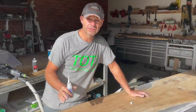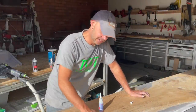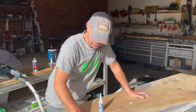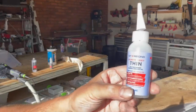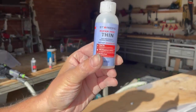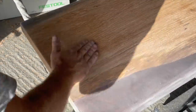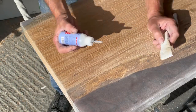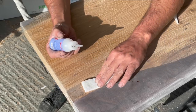If you've seen some of my other videos you'll know that on the sapwood I usually use Smith's penetrating resin. But let's say you're quite late in the game — it's really getting near the finish and you want to finish it off, you know, not wait 24 hours for the cure. You can actually use this — it's like a CA or super glue and it's really thin. I'll show you what you can do. We've got just a little bit here, it's not a big area which is really good. I get a scotch brite and just drip it on and then just rub it in.